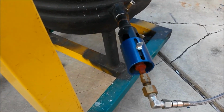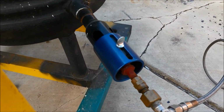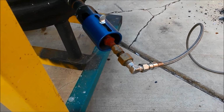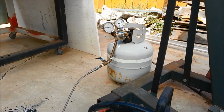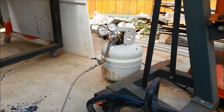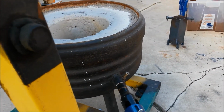This is a T-Rex burner with a slide gate. It uses a MIG welding tip. I don't know which size it is. I'd have to look. Yeah, hook it up to propane on an old gas regulator. But you got to get the pressure up. Your normal barbecue is regulated to 5 pounds, non-adjustable. So, like I said, I got to get up to 10, 11 pounds, sometimes 14 or so.